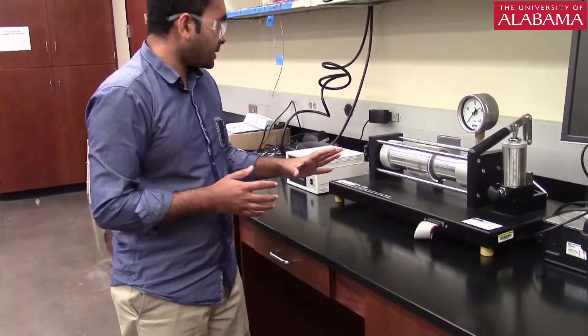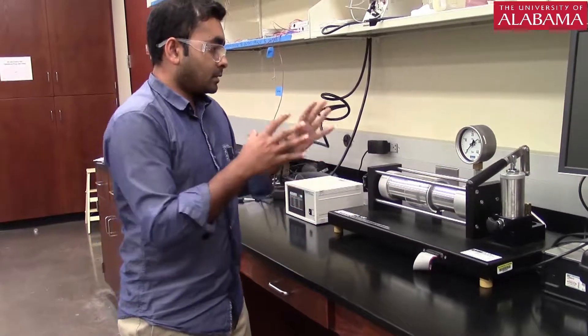This is the experiment. Go back to your lab handout, check the dimensions and material properties, and use the formulas — Mohr's circle and 3D Hooke's law — to convert stresses into strains, then compare theoretical and experimental results.